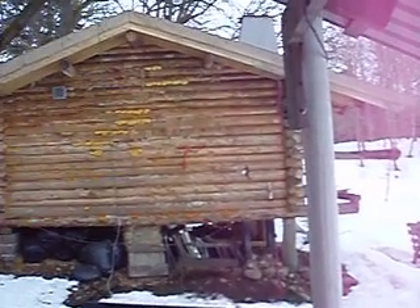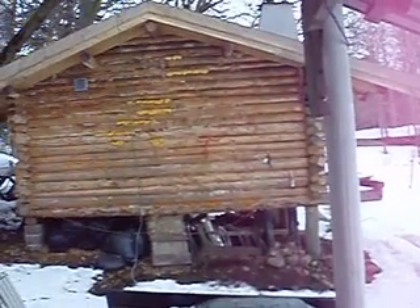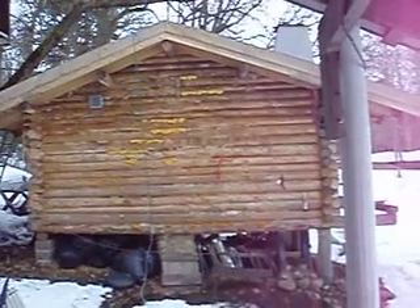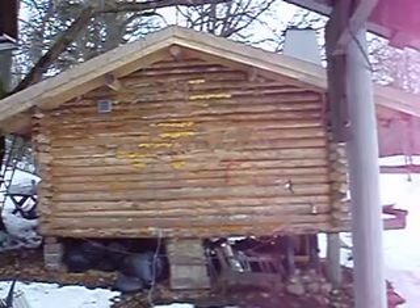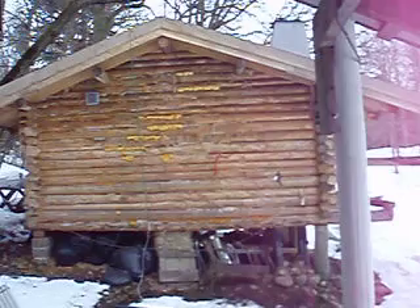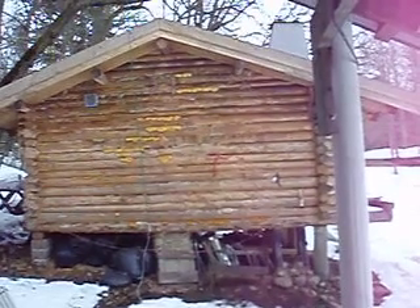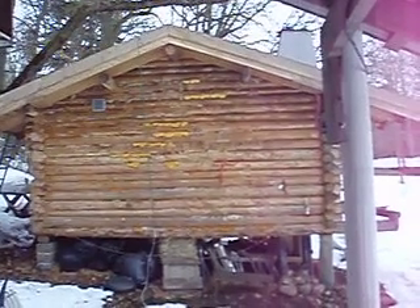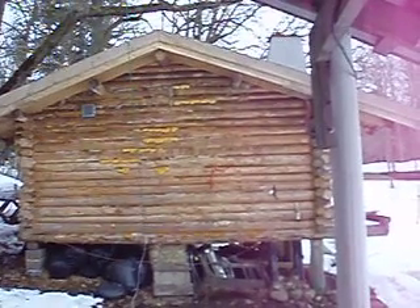In the log house I have connected all my indoor lighting to the battery bank. I have changed all the light bulbs to CFLs. I haven't figured out how many watts they are drawing — three at 11 watts is 33 watts, and three at 7 watts is another 21 watts, so about 60 to 70, maybe 100 watts total.